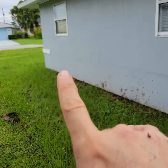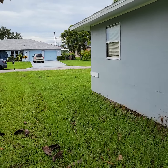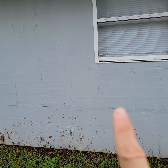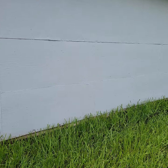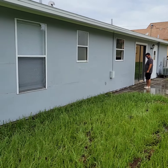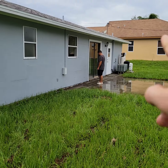So I'm going to get about 60 feet of this 1x6 and we're just going to continue this all the way around. Try to find a level and make sure they all match up, and just shoot them on with a trim nail gun. That'll cover that whole seam and make it look a lot nicer — we'll get 60 feet of that or so and wrap it all the way.